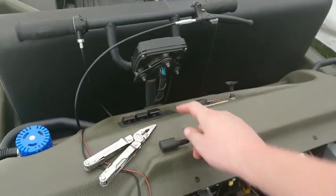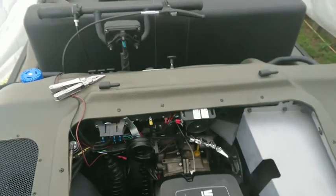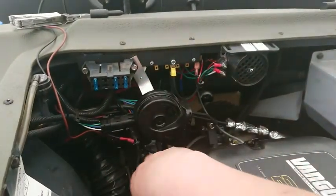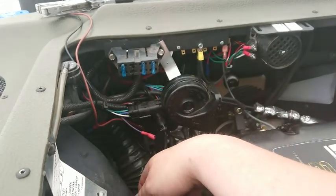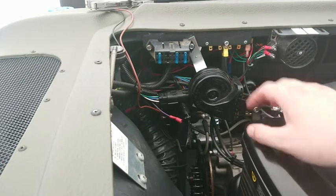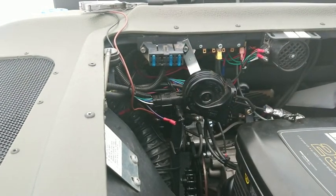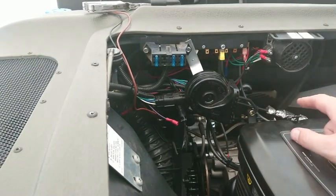The intelligent among you may have questioned why I haven't run off the extra auxiliary circuit - there's still something else to come for that, which will probably need a fuse. For the bilge pump I'm going to put an inline fuse at the battery. All four of those circuits are taken up and there isn't actually any way to connect to that block. There are some strange little bullet connectors in there and I don't know where they go - and I don't have a circuit diagram. So it's safer to not use that. There are some negative rail connections set up for something I'm not sure what. I'll have to find out - maybe I'll get hold of the dealer for some diagrams. For the moment it's safer to go directly back to the battery.